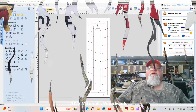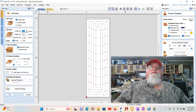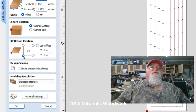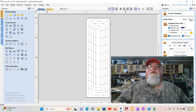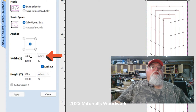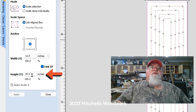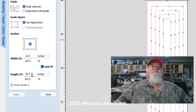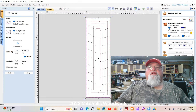I've set up my dimensions in VCarve Pro — 12 inches wide, 40 inch height for the material, and an inch and a quarter deep. I'll be setting my zero from the bottom left, which is my G55. I drew a rectangle in here that's 12 inches wide but the height is 39 and a half inches — a half inch short — because I've got a clamp down on that end. I'm going to try to stay away from that clamp.